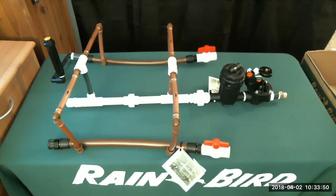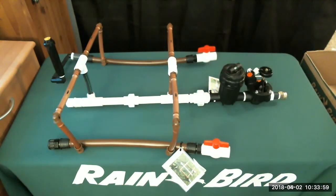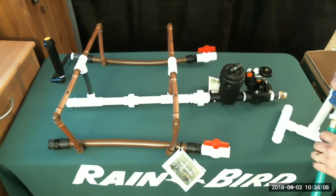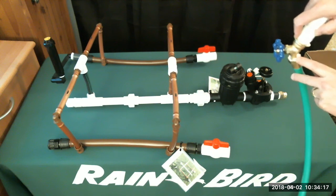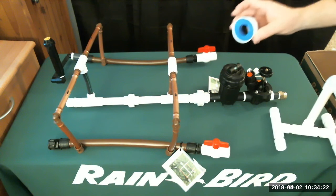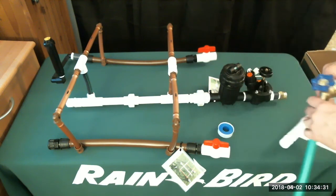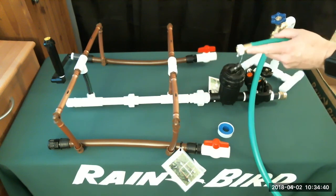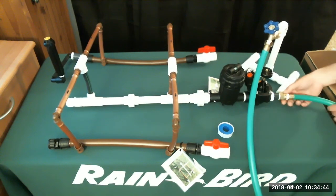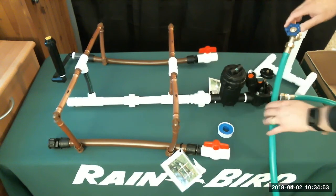If we're going to do this outside, I did provide you with a 5-foot hose, and don't forget to put the washer on. And I said about keeping everything really tight as far as the fittings and everything goes. So I brought in a hose bib, and it does work. You can see I can turn it on and off either way. And if you look on here, there's Teflon tape. Always keep an extra roll of Teflon tape, because this will save you when it comes to leaks, because you're not always going to get different situations at different hose bibs and job sites. So this is here, so we can hook this up. And again, you'll see I even have Teflon tape on the end of the hose. So when I put this into the hose end connection, the brass one, we've got a great fit, and it's going to stay, it's not going to leak. So we have all that done.